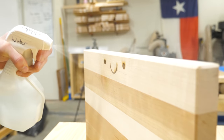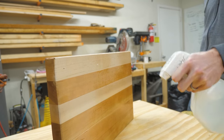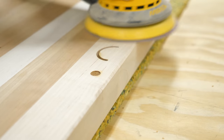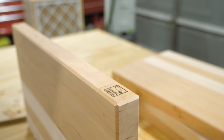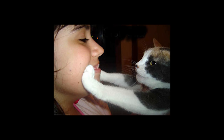We're going to get the board ready for finish by sanding at 220 grit after raising the wood fibers with a little bit of water. This keeps the board smooth — again, it's going to get wet and the wood fibers are going to swell. But if you've already swelled them and sanded them down, the board will stay smooth even if it gets a little bit of water in it. Now you're going to get your little man and brand him — we don't want this guy getting lost and it only hurts for a few minutes.